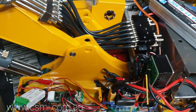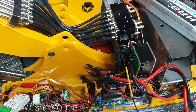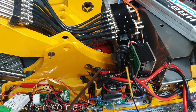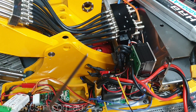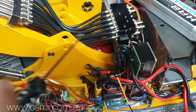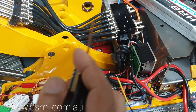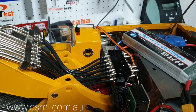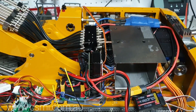There is a switching relay up here — what it does is avoid sparking and allows more current, so it's used when connecting the battery with a smaller switch. There are three speed controllers: one for the car body rotation and two for the tracks. This is a manifold that sends all the hydraulic oil from the valves. This design allows flexing of the hoses — a similar design to what Liebherr uses on real machines — so the hoses have a nice soft curve and don't get kinked as you move. The blue section next to the battery is the speed controller for the pump.